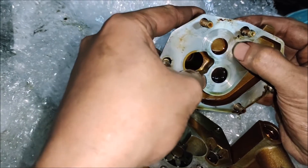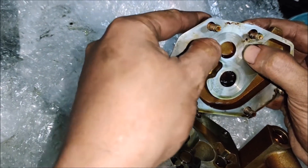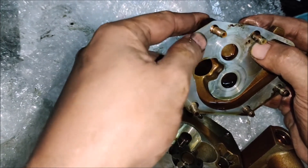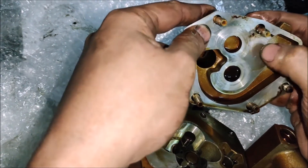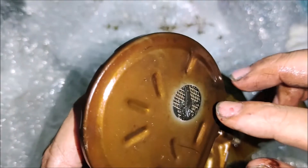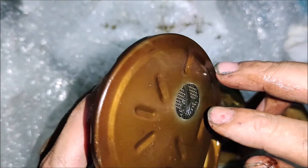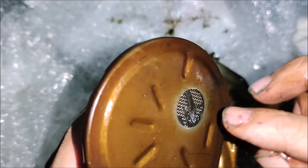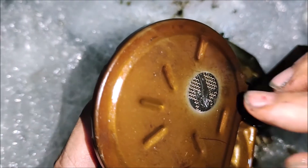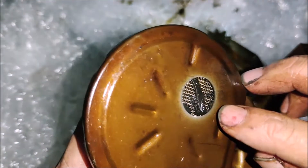There's wear here at this rear housing. As you'll see here at the strainer of the oil pump, this is possibly the reason for the low pressure of the oil pump, because the filtering area is so small it can easily get clogged by debris like this one here.